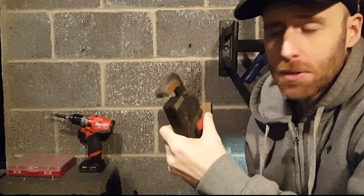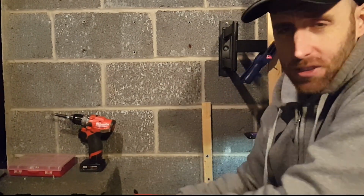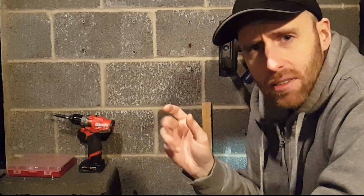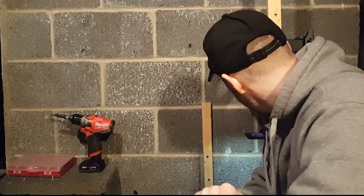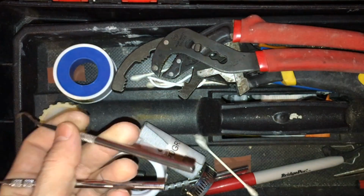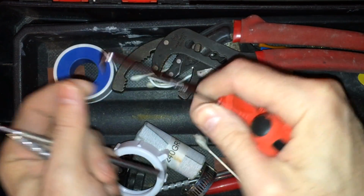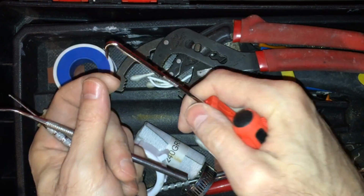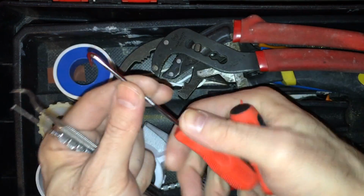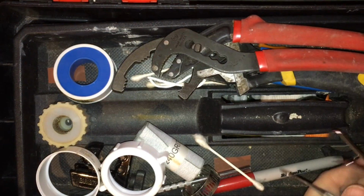If you don't have galvanized pipes, you probably don't really need pipe wrenches. Most of the wrenches that you'll need are for the hex couplings and fittings, like the nuts underneath the faucet. Scraping tools and picks are really handy to have. They have them with these rubber grips. These are good for scraping out things from threads, scraping out and picking off O-rings and washers and things like that. So these are really handy to have.